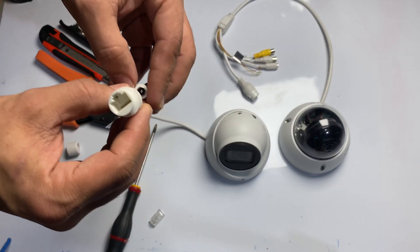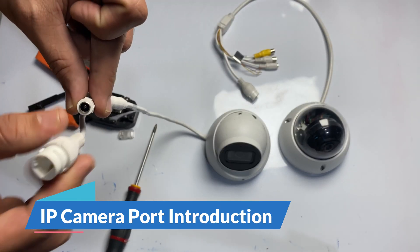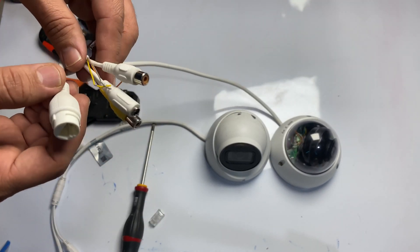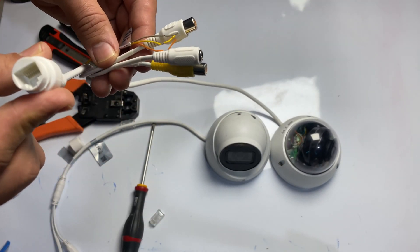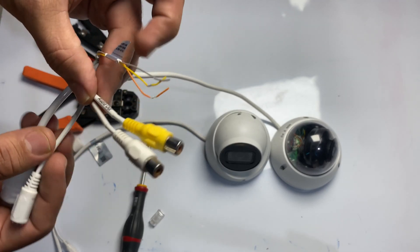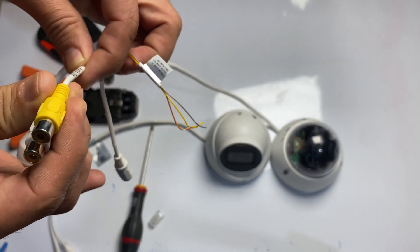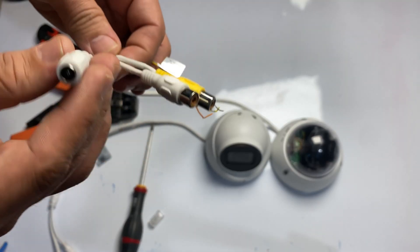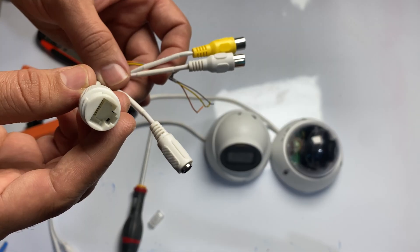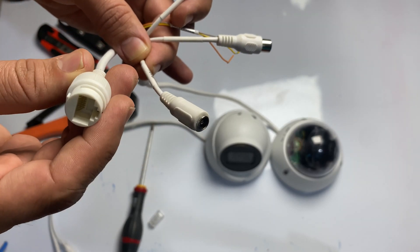You can see that this IP camera has two ports — one is for network and one is for power. This other IP camera has many ports: one for network, one used for alarm, and these are used for audio in and audio out, meaning it has speaker capability. This port is also used for power, which is used when we don't have a PoE switch.